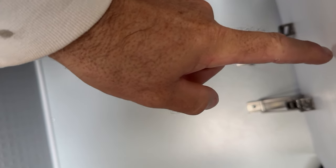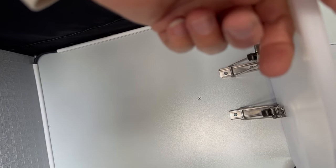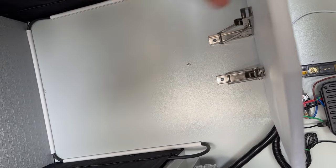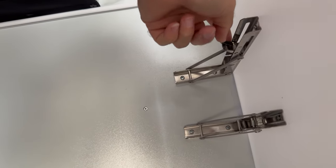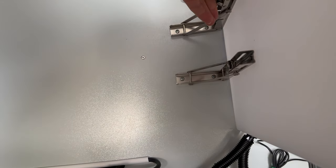I'm also going to put a little circular stainless steel sleeve with a lip right in the middle, and a thin telescoping pole that goes down and touches right there — just for stabilization, so it doesn't flex when you put weight on it. It can be easily popped off. Then to release the table, you just hit these clicking levers — one here and one on the other side. Click both and the tabletop comes down, and there you have your table flat against the wall again.